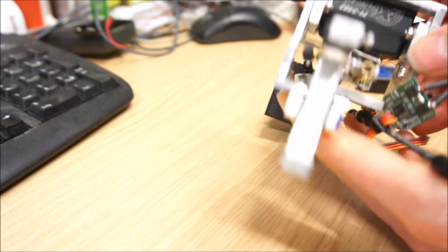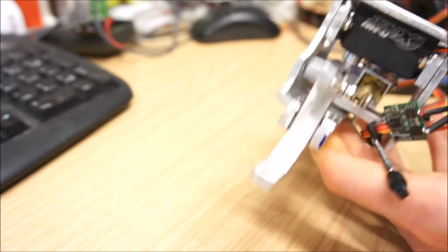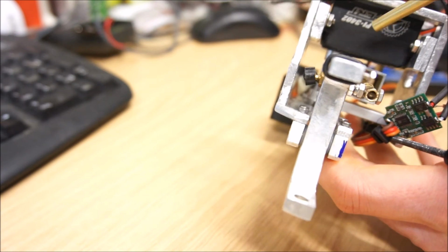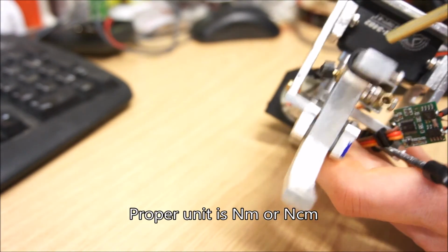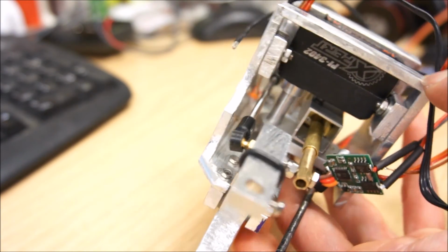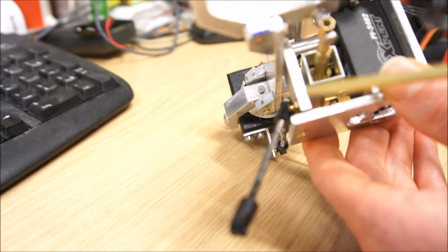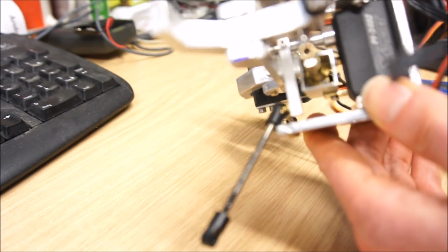And the other thing that I forgot was to discuss how the steering servo is arranged. So we have a PI 3402 Expert, made by Expert servo, up here. Very strong. They call it 16 kilograms, so obviously kilograms is not a measure of torque, but that's what the servo industry decided to use. So kilogram centimeters. It sits up here and has a long 1/4 inch servo shaft that you can see here. That allows me to move the servo arm, which I built myself. So that is the servo arm here, and that arrangement allows it to straddle the gear motor that does the wheel lean.